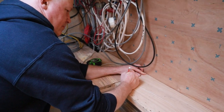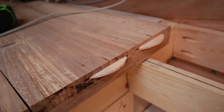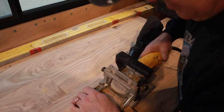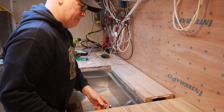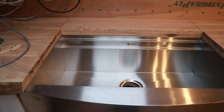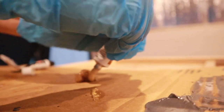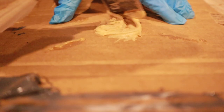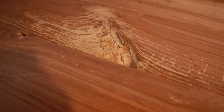We're going to put the biscuit holes in. Now we've got a dry fit, so we're going to put our epoxy in any place there's a rotten chunk of wood just to seal it up so it doesn't continue rotting. We've got one more big rotten piece of wood to fill with epoxy.